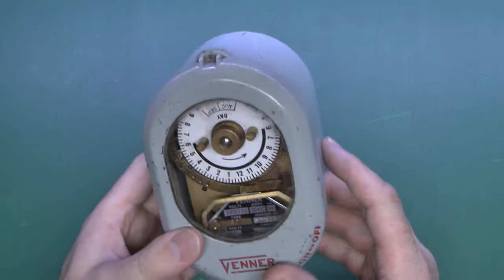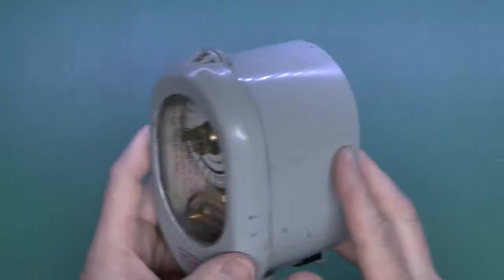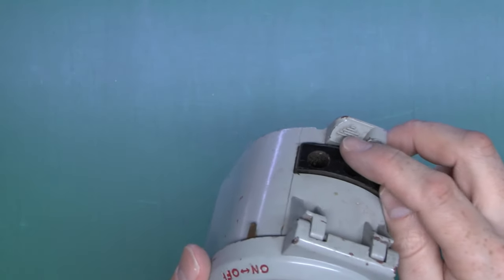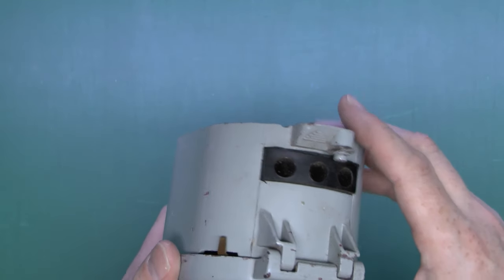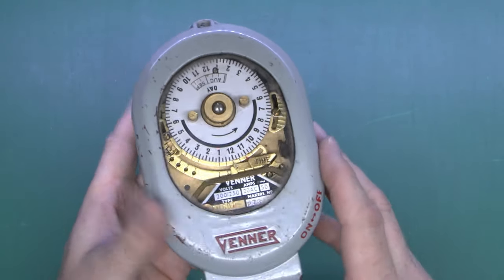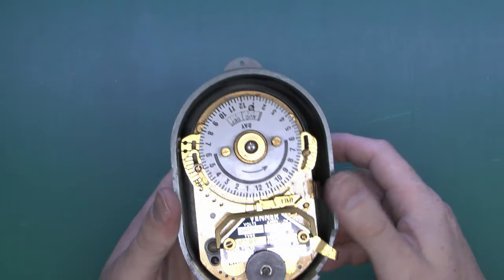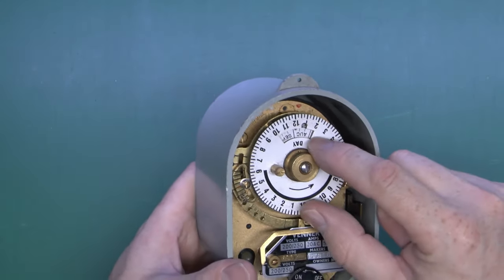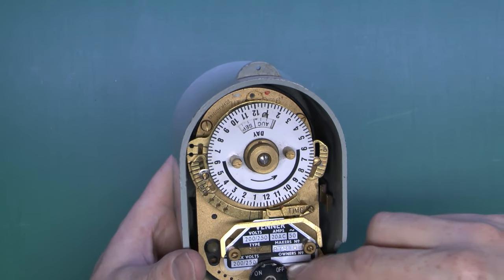Now the third one we've got here is somewhat different in design and it's also a bit older than the other two. At first glance it's a similar arrangement, although this one is installed in a metal case. Again there are holes at the bottom here with a plastic insert where the wiring would have entered. On this one the earth connection is actually on the outside of the case on this separate screw, and just three wires there which will be the neutral, line in, and of course the switched line out. We've got the on and off lever here on the side - push it one direction for on and the other for off. The front of this one is actually glass and so this entire case is made of metal. Inside this particular timer we can see it's got the 24 hour dial again - basically one rotation for 24 hours - and it also has this additional inset section which has got the months listed inside.